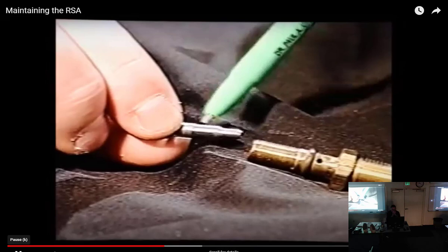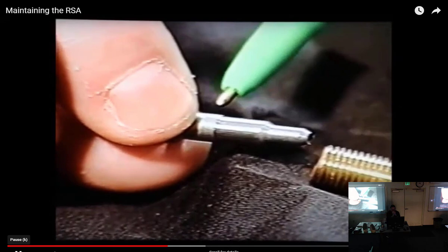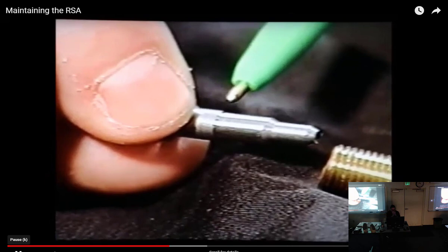The inserts of these high-flow nozzles are identified with a step on their circumference and have a larger diameter to prevent installation into the wrong body. Always refer to the engine manufacturer's publications prior to ordering replacement nozzle assemblies.